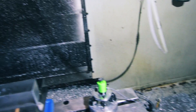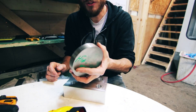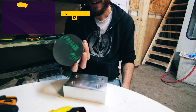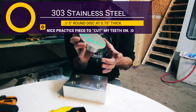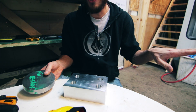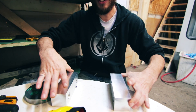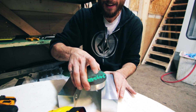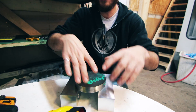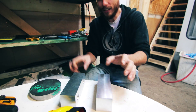I need the soft jaws to grab this. For those that don't know what soft jaws are - it's for grabbing irregular shaped stuff. I'm gonna be cutting this stainless and I wanted to make sure I had a really good grip on it because it's gonna be thin, and the best way to do that is use soft jaws. These replace the hard jaws in my vise like so, and then they clamp like this. I'll cut the shape into the soft jaw so the part is sunk between these and they'll grip it really well. That's what I'm up to today.